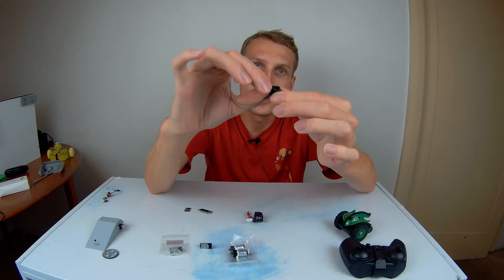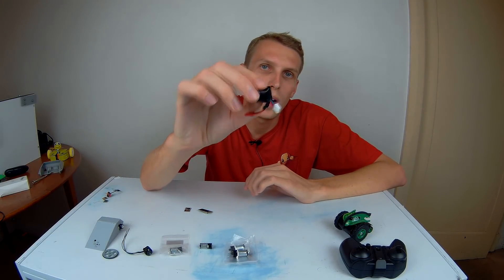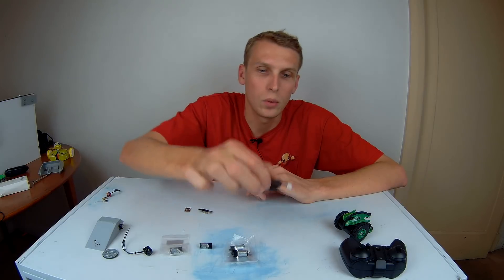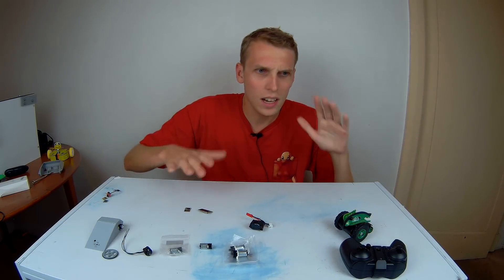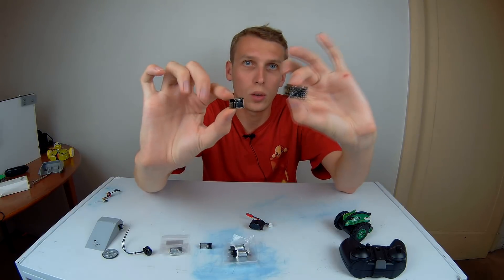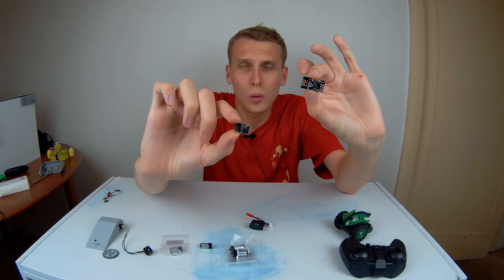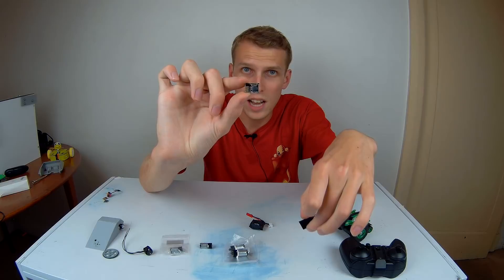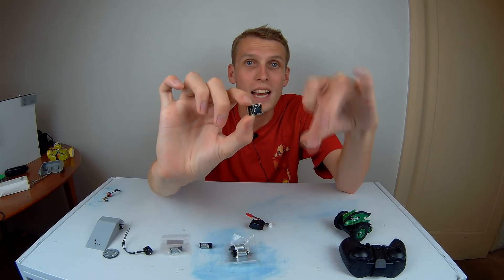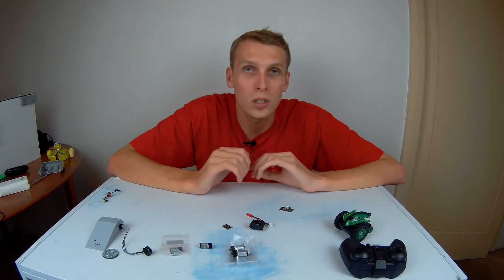This thing is absolutely minuscule. I do have smaller ones, but we'll talk about those in just a moment. Of course I have a tiny little 100 milliamp hour two-cell battery that we made together on this channel — you can jump back and look at that video. The thing that's really made this real for me is this tiny mini version of the 2.4 gigahertz module I usually run with my Arduinos. This big guy is about two and a half to three grams, but this small one is half a gram — that entire communication module is half a gram, which means I can get away with putting my Arduino system into a 75 gram robot.